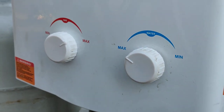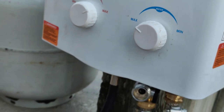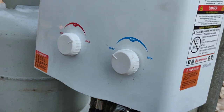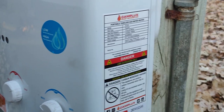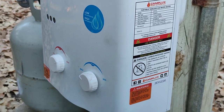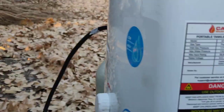The adjustments on this are pretty tricky — it takes a little while to figure out. Basically it blends the cold supply water coming in with the hot water coming out. As it is, it puts out a lot of heat. I have it set to maximum temperature because I have a hot and cold valve. But if you're only using one outlet or you've got kids and you don't want it too hot, you can adjust it — right now it comes out scalding hot.